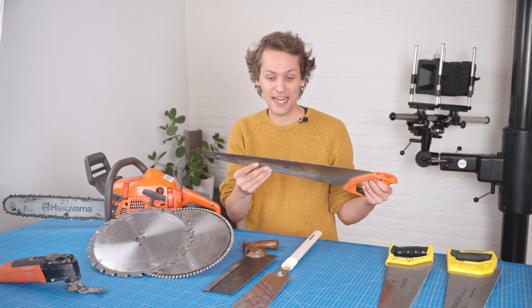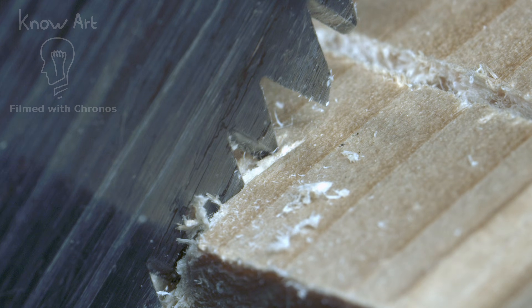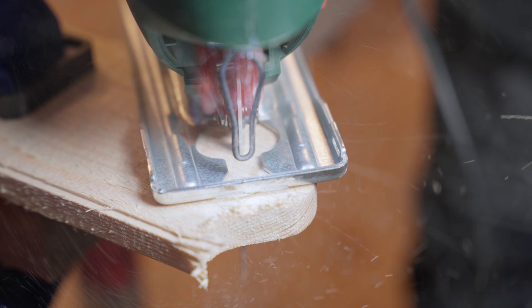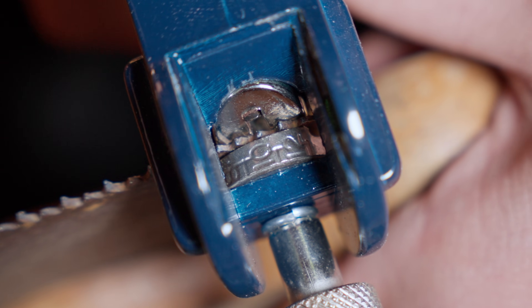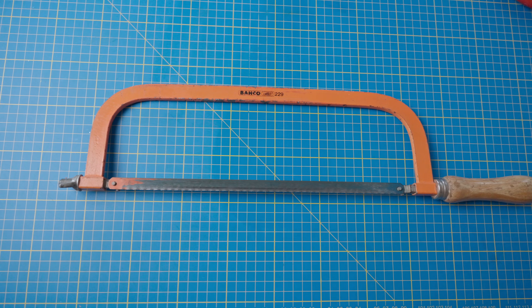We didn't talk about saw set yet. The teeth on a saw are bent outwards a little bit, so that they make a cut that's slightly wider than the blade itself. If you have a short blade with a big set, you can easily make rotations and turns. Setting the teeth on a hand saw is generally done with a tool like this — it literally just pushes a tooth over. But when you have tiny, tiny teeth like on this hacksaw, they just put waves into the blade instead.